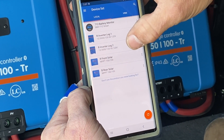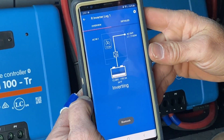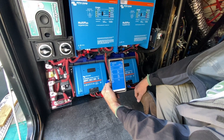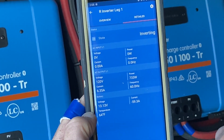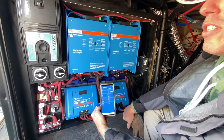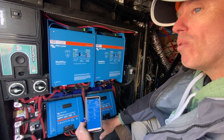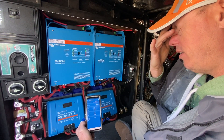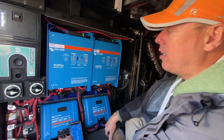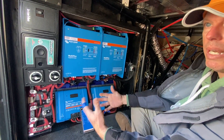I think the temperature sensor on the fireplace kicked back on. It was pulling 11 amps. As long as we don't go above 23-24 amps on an individual leg, you're fine. When you go over that, that's when you hit your overload. If something else would have kicked on, it would have probably shut itself down, waited a few seconds, then turned back on — that's what happens when it goes into overload. Our draw is down to about 12-13, but it's still drawing out of the battery bank, not replenishing yet.